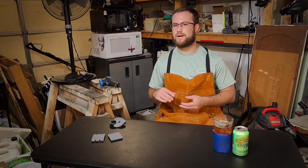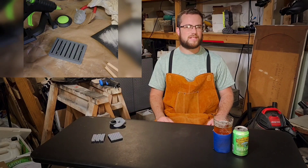Up to this point, everything I've talked about is very standard procedure for printing metals with Virtual Foundry filament, and can be found in much greater detail on their website. However, this is where I'll be deviating from the path by introducing standard household microwaves into the process. For the debinding and sintering to occur, you need high temperatures, which is where a traditional programmable kiln would come in. While I and many others have access to these kilns, they're out of reach for many reasons to others. In my workflow though, a microwave oven is used, together with what I've dubbed as modular heating elements. These elements are made of a special but simple set of ingredients that when put together in a microwave, they act as a heat collector and take the place of a traditional programmable kiln.